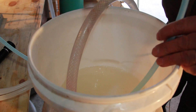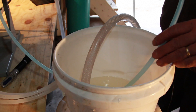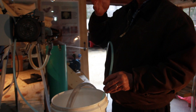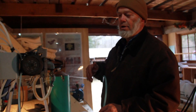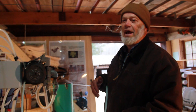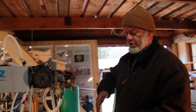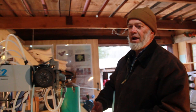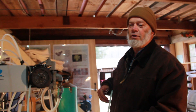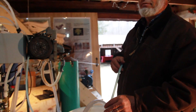So by pushing a whole lot of liquid through all the time, we can keep it operating at a pretty good clip. A commercial RO unit like we have in the back room here has a second pump that really pushes liquid through fast to keep that happening. This unit does not have what we call a recirculation pump, so we get the same sort of effect by running the sap through fast and then running it through multiple times. That keeps the membrane functioning better.